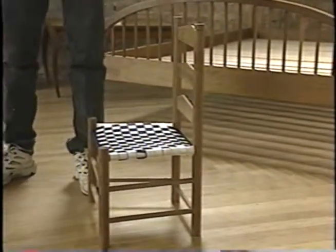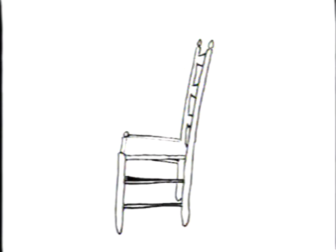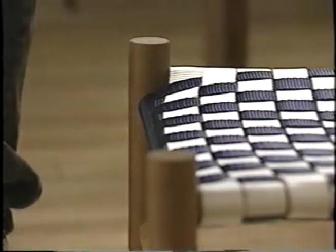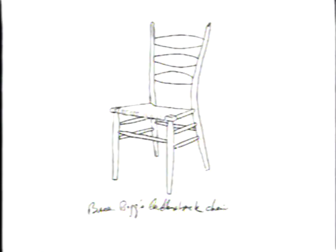To ease this angle, the Shakers built many of their chairs tilted backwards slightly. You could also bend the back legs 5 or so degrees above the seat. And there's also the top of these two front legs sticking up past the seat, where the back of your thighs will be feeling them if you spread out a bit in the chair. Shaping the tops to a gentle curve helps a little, but the only real solution involves mortising the tops of the legs into a seat frame.